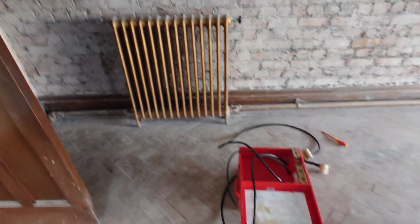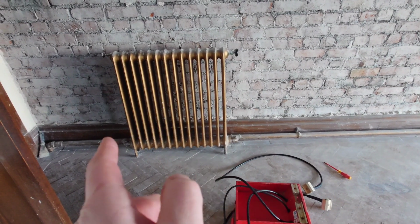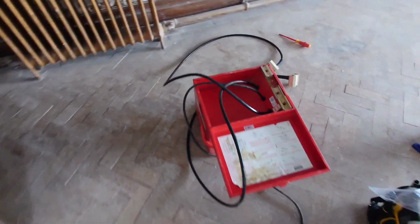They're doing a big opening there, putting a steel across, and that radiator's got to come out, but the system's enormous and I don't really want to drain it down, so I'm going to freeze it there and freeze it there, whip the unions off, and hopefully it holds.